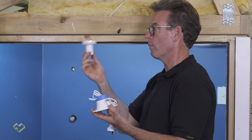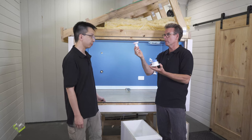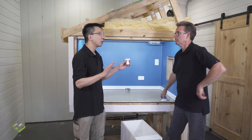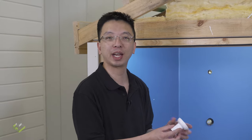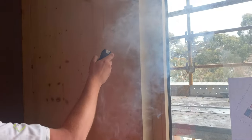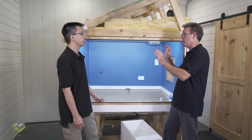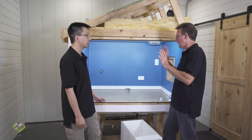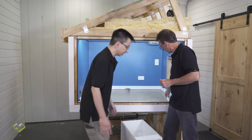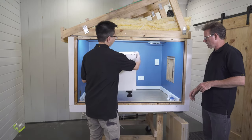There's nothing wrong with surface-mounted lights — they're always going to be reasonably airtight. You may get a tiny bit of air leakage through the screw holes, but when you look at the whole situation compared to your doors and window gaps, it's nothing. There are far larger gaps than that to worry about. And again, we're not aiming for a completely airtight house — some of these tiny little leaks around GPOs and light fittings are acceptable in 95% of cases.